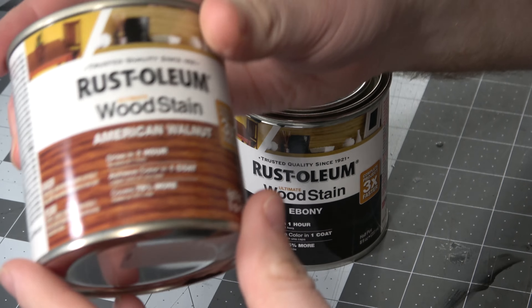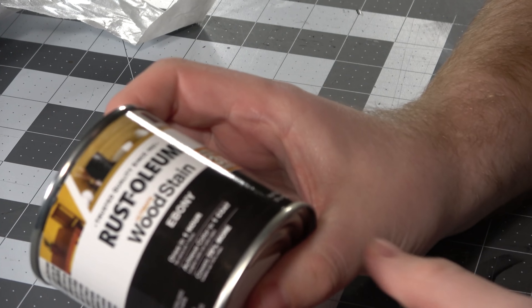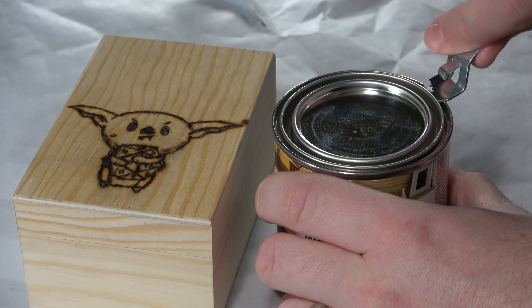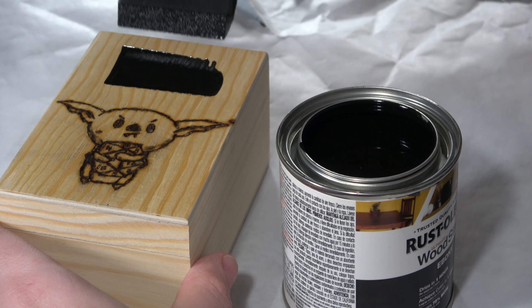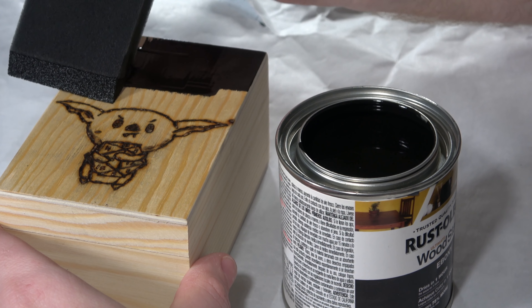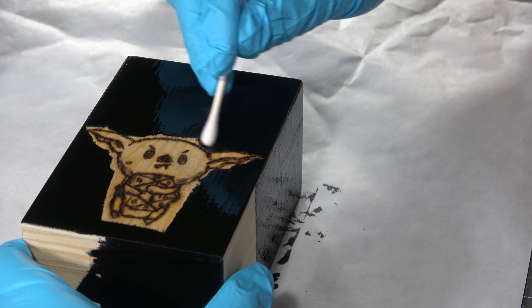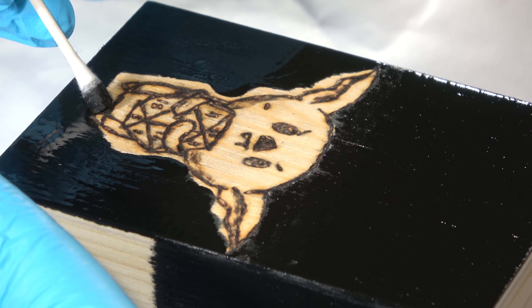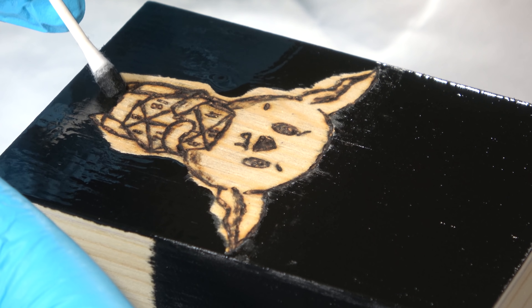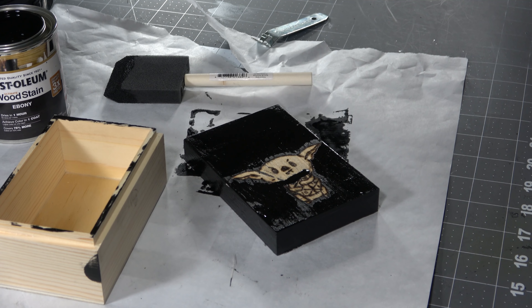Both sets are burned and they look fantastic. You could totally put a name up there or stop here, but I'm going to go ahead and stain it. I'm using American walnut stain, ebony stain, and early American stain which is a little lighter. I throw down some freezer paper because liquids won't go through it. I dip the spongy type brush into the stain and wipe it over the top of the box. I use a Q-tip to get into the tiny crevices — I really didn't want to mess up all that wood burning work.